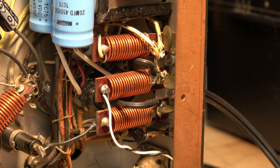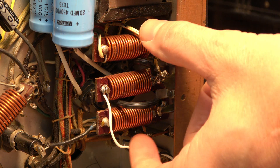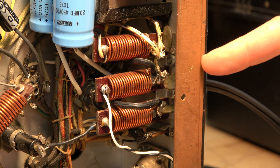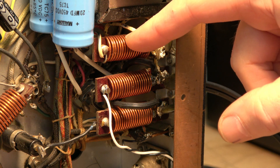To start the process you need to take out the screws and nuts down here and pull this RFC assembly up out of the way. That'll expose the AC cord coming in from behind. We can get the hole drilled, get her wired up, and put this back in.